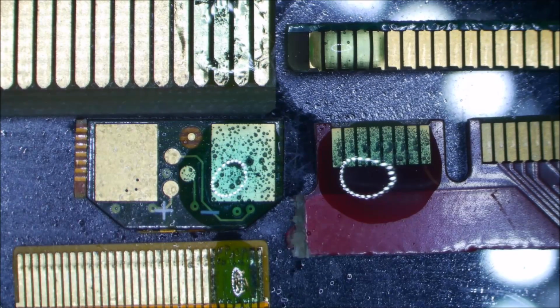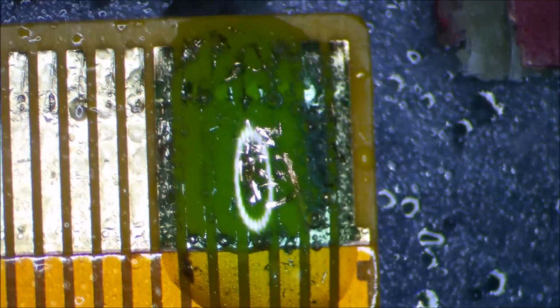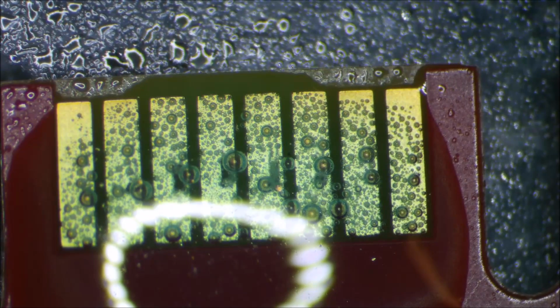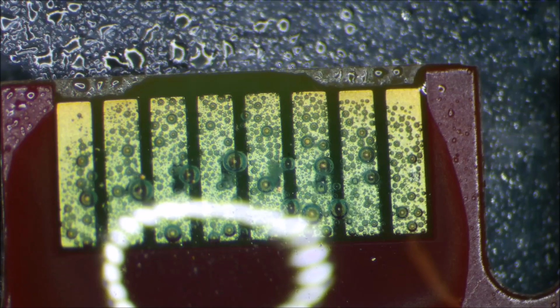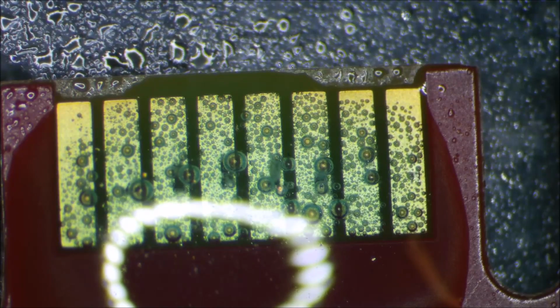Okay, so about 15 minutes or so have passed, and hopefully the time lapse showed something. Now if we zoom in a little bit, get our focus done, you'll see that what appeared to be the finished plating has pretty much completely disintegrated. The gold from this, that, and that is likely to end up basically as dust when you're trying to recover it rather than coming off as nice foils. Now, nothing wrong with recovering dust. You just have to understand in terms of the price that you pay for it, whether it's worthwhile for the gold that you're going to get.